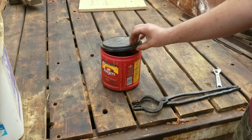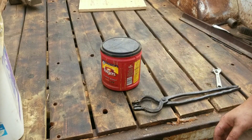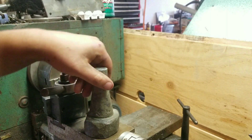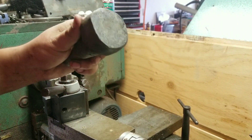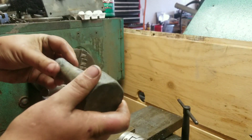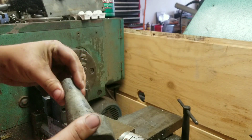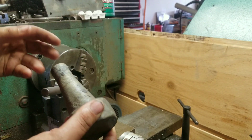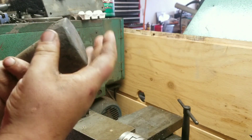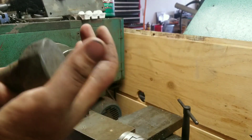You've got to be super, super careful with hydrochloric acid. Now that this forging has been sufficiently pickled, it's time to start machining it. The first thing I'm going to do is grip it by the end of the taper — the sort of straight portion — and put a center in it so that I can start working on the end where the boring head will mount to.